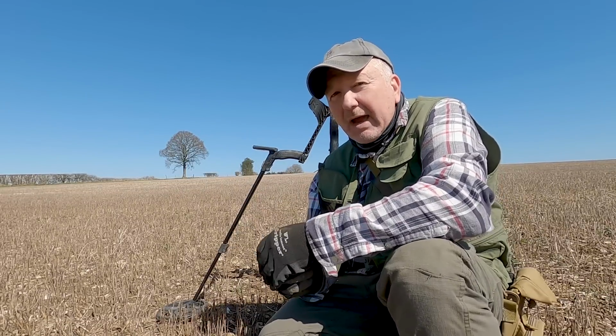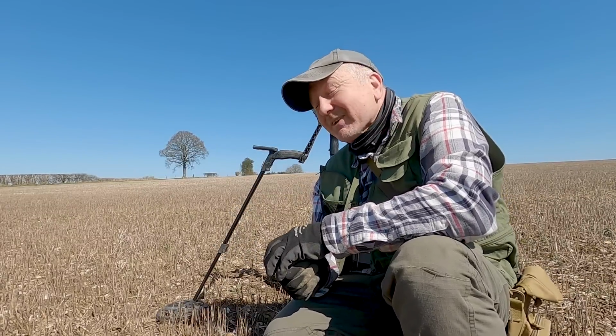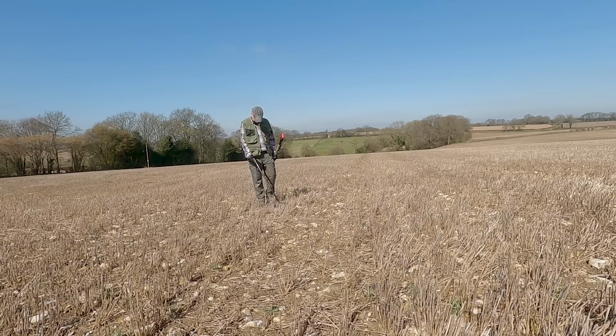So come on, let's get out, have a wander around. Don't know what we're going to find, but you're welcome to join me. Although I'm running this machine quite hot, I've got sensitivity at 97, so that's quite leery. It's dealing with all this iron really well. Have a listen. Can you see what I've done there? I've got the sensitivity really high, so it's almost acting like a threshold in the background. So I'm just waiting for something to spike over the top of it.